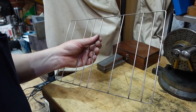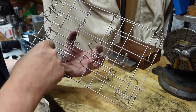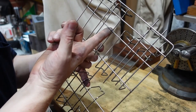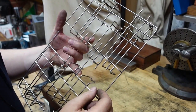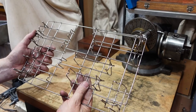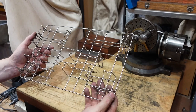I've now put all the cross pieces on using a similar technique to putting the wires on, with a couple of longer pieces to bridge awkward gaps — I'll trim those off with the Dremel since I can't get in there with the angle grinder. I did have a couple of problems: the trigger on the welder stuck on and basically fused right through, so I'm going to have to go back with the TIG welder and patch that up. Apart from that, it's quite a nice solid little thing. After a bit of wire brushing it's complete and done — an interesting little use of cross wire welding, but very effective. Thanks for watching and we'll see you for the next one.